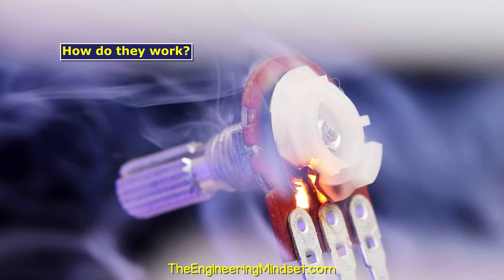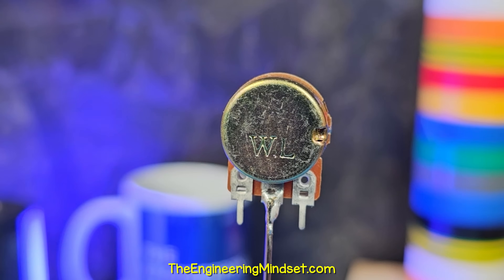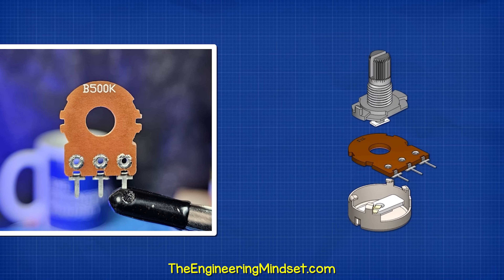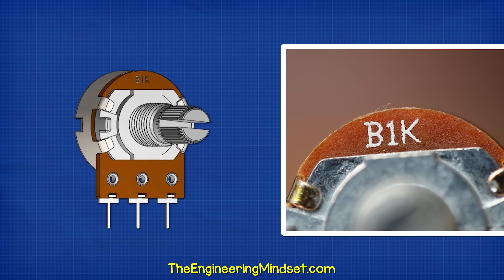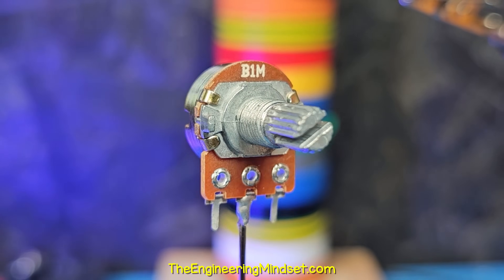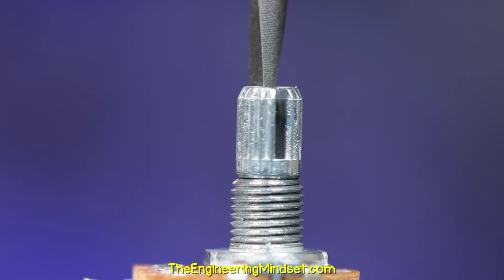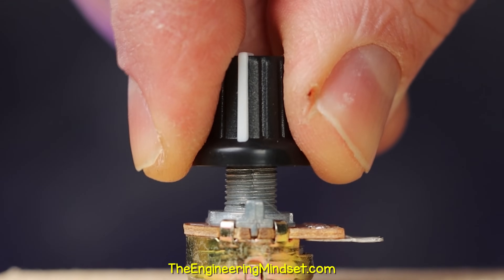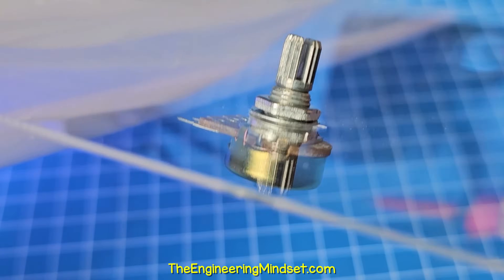So how do they work? If we look at a typical rotary potentiometer, we notice there is a metal protective casing on the back, which is simply held in position by the small arms on the front. All of the parts connect onto a small brown sheet of insulation. Along the top edge, we usually find some letters and numbers. We then notice a long shaft rising up off of the device. We can rotate this to alter the resistance of the component. You'll see there is a slot cut into the top for a screwdriver, or on the side are some ridges which help us grip the shaft. We can also attach a knob onto this. At the base of the shaft, there is a threaded section which we can use to attach the component to a sheet of material.